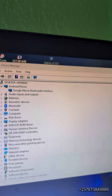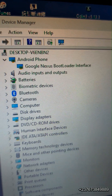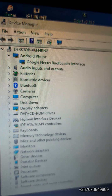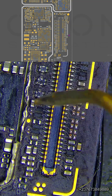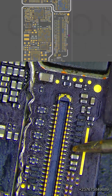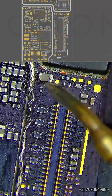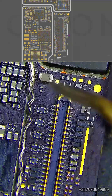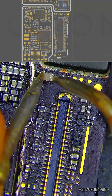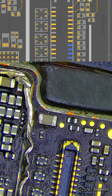After mounting the RAM, the phone showed signs of switching on, but it did not actually switch on. The phone connected straight into bootloader as soon as you try to switch it on. Nothing would show, but the phone was detected on my PC in bootloader. Because of this, I knew that there was still something wrong with the mobile PCB. I tried looking for a short — there was no short — until I found this capacitor shorting.